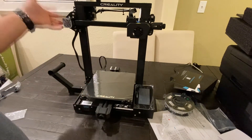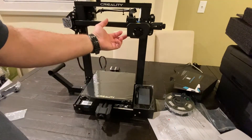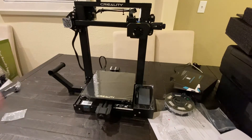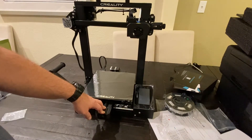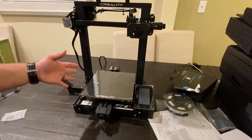The coolest feature, which I'm going to explore right now, is that it is self-leveling. There is a little IR sensor down in there that will self-level this printer. For most beginners, that is the most frustrating part — trying to level the print bed. With this, it should be a couple of buttons and it should level itself. This printer also has a 32-bit motherboard, meaning it has upgraded steppers which are soldered onto the motherboard, so it should be very quiet as far as operation goes.